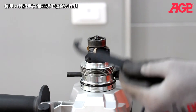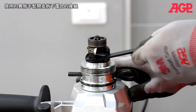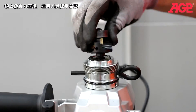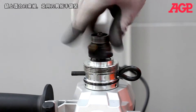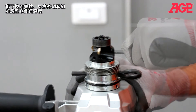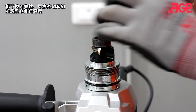Use the hook spanner wrench to loosen and remove the tool holder. Thread on the tool holder and tighten with the hook spanner wrench. Remove the spindle lock bar and replace the support deck and adjust the beveling height.